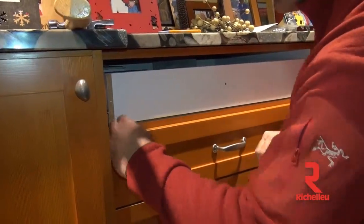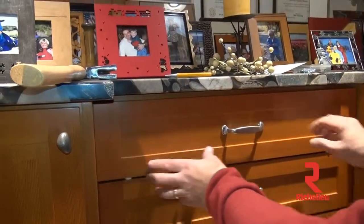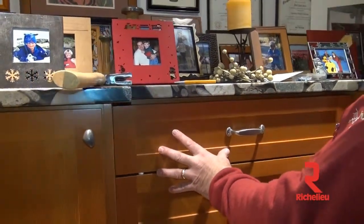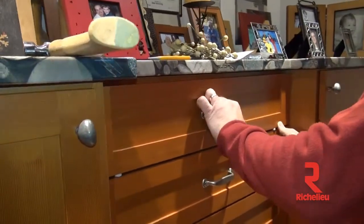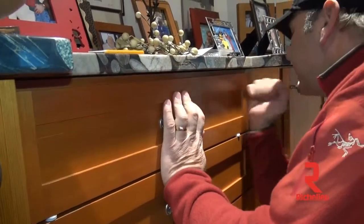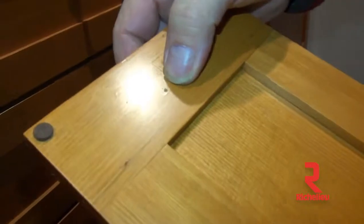I like to put the shims out just a little bit, right like that. The next step is to take our drawer front — here we've got our drawer front — we're just going to take it up there, hold it, and set it on those shims. You notice we've got our spacing perfect. We're going to make sure we're lined up side to side, right on the money. When we get it all lined up and feel good about it, we're going to take one shot at this. I'm just going to simply go like that, setting those nails in perfectly. Now I pull that off and I've got my marks right there, exactly where it's going to line out.